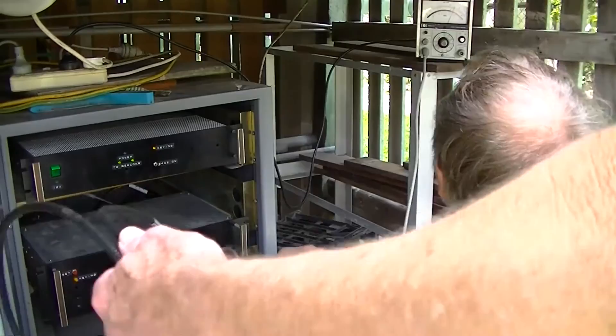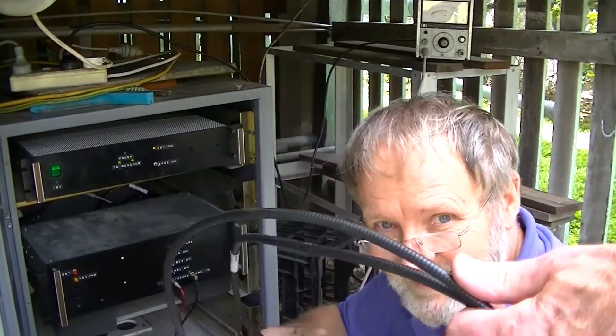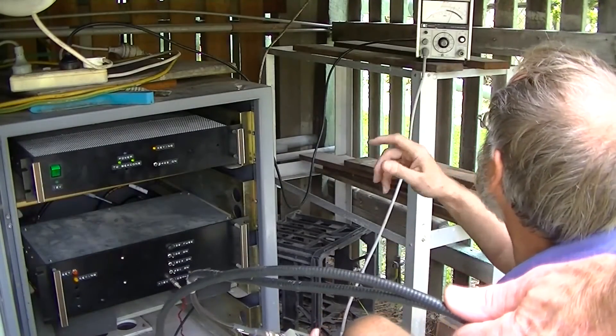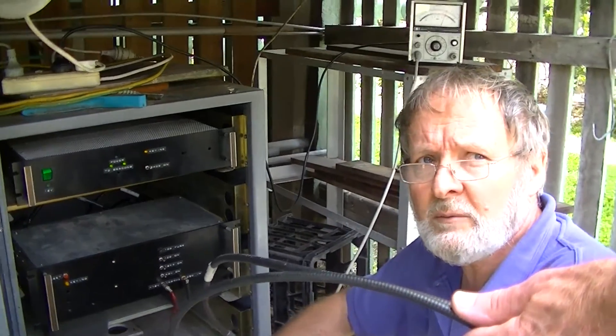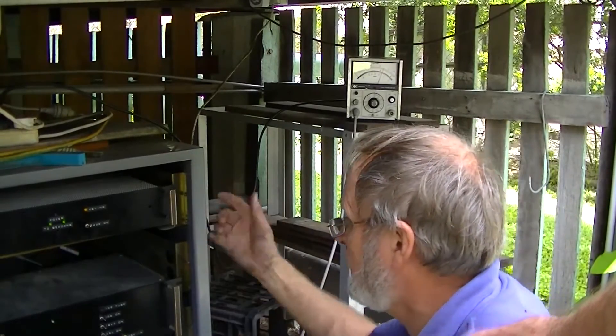No tune-up required. So you're getting enough out? With these two bits of attenuation, it's one and a half dB down on 100 milliwatts on the scale, so that means it's something like 200 milliwatts full power. So that's as it should be.